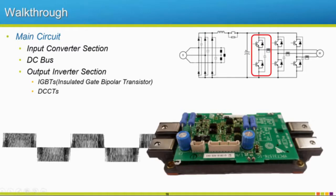And then we have an emitter and a collector. Also this portion here is our freewheeling diode. This allows our drive to take in regen. Whenever we decelerate a motor, we're actually running through these diodes and filling back up our capacitors. Once we fill up our capacitors, though, they have a certain limit. The problem with this drive is you can't go past this front end. Once that comes in through the diodes, it can't backtrack out into our incoming line. So we're stuck filling up these capacitors.